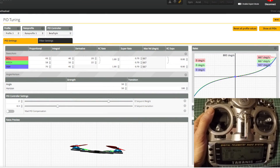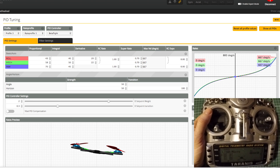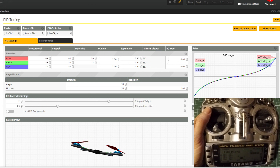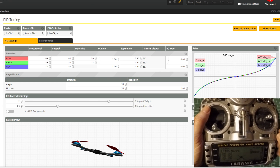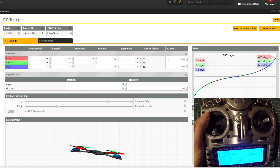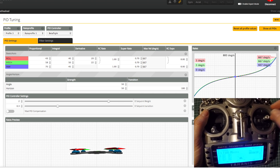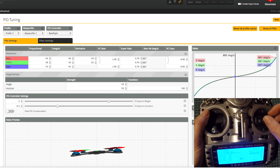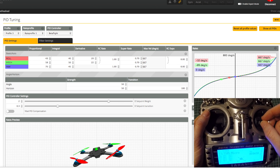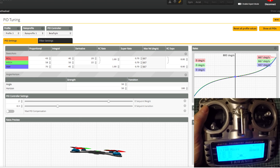My quad in the field was using my MW OSD, which lets me change some of the PID tuning settings. I've come to Betaflight now because this newer version allows you to do things so much more easily than using numbers. This is on one of my little brushed quads. Betaflight has given this really good picture of a quad, so you can see full stick movement equals a not-super-fast spin. We've got a nice little curve here, so stick movements at the first part aren't too big, and then as they go to the outside they get bigger. This is what the super rate is — that used to be called super expo, and before that I think it was called acro plus or something like that.